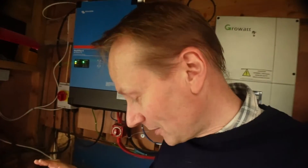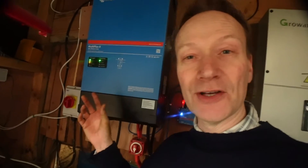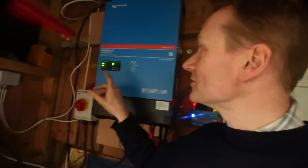I'll move on to the new charge inverter which I've got behind me. It's a charge inverter from Victron — I've paid for all of this myself, I've not been sponsored by anybody. The reason why it's called a charge inverter is because it's got a dual role: it charges the batteries up, and it also converts 230 volts into 48 volts, or 48 volts back into 230 volts for the house.